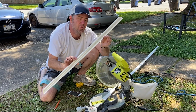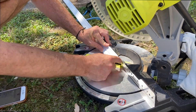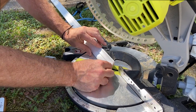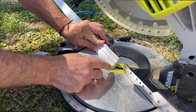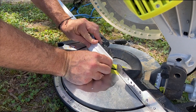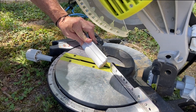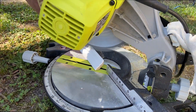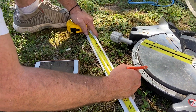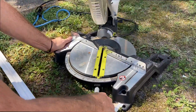To avoid taping to the wall, I plan to install this bed mold — it's miniature crown molding. The way this is cut, you want to put it upside down with the flat sides down on the surface, so you actually angle it and cut it upside down to get this to work. My measurement is 59 and a quarter, wall to wall, long side to long side, so I'm going to cut this at a 45. I'll mark my 59 and a quarter right here — that's to my longest point — then back to the 45.